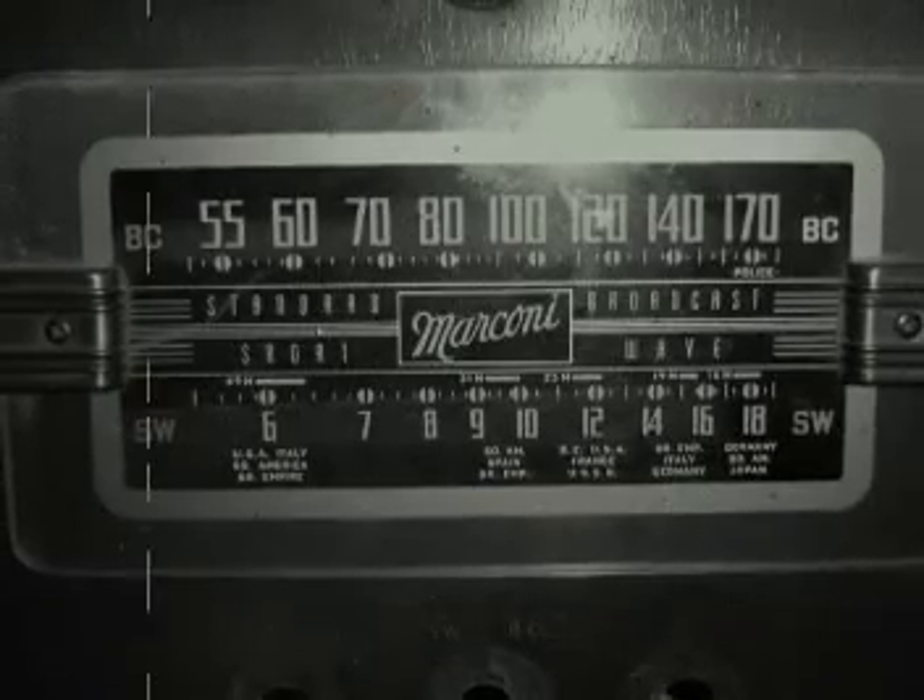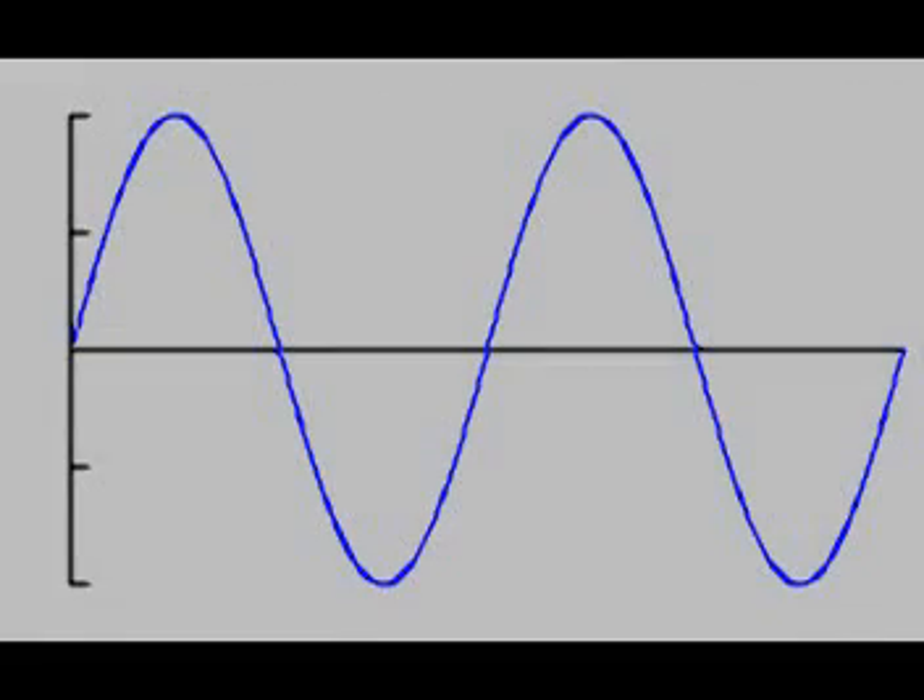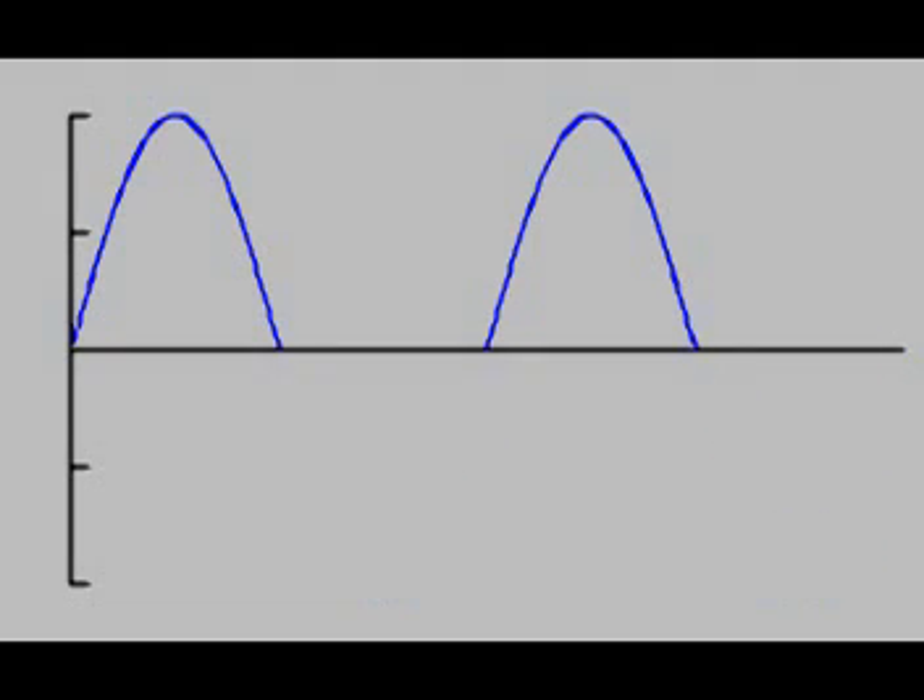Don't be like that — it's not as bad as you think. What we're looking at here is your basic alternating current, or AC. Now, our radios use direct current, or DC. So since we get AC current out of our standard wall sockets, we need to use what's called a rectifier. A half-wave rectifier clips either the positive or the negative half of the AC wave, but because only half of the power is used, it's very inefficient.